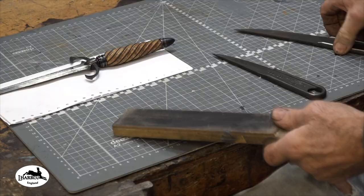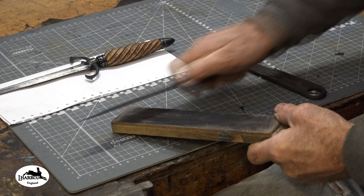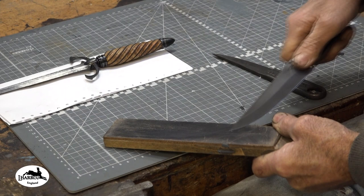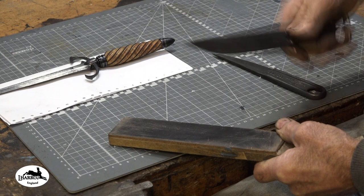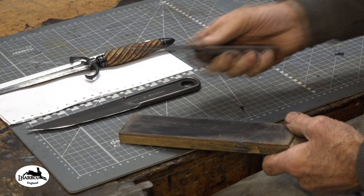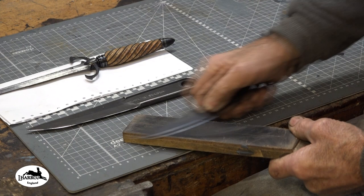I have given both a good pull over the diamond stone. Pull them over this strop now at the same angle. Yeah, they're not high HRC. I'd estimate 57-58 HRC, but you know, I wanted a steak knife. It's a big steak knife, but it'll definitely cut steak. We'll see if they'll cut paper. They should do.